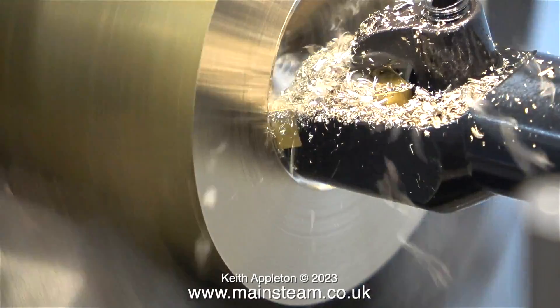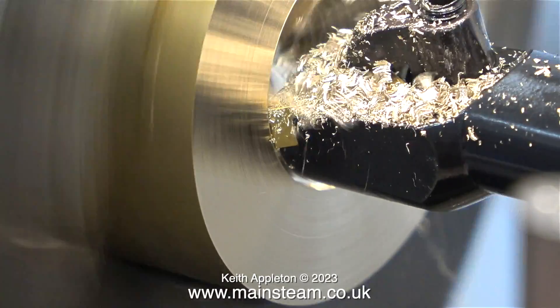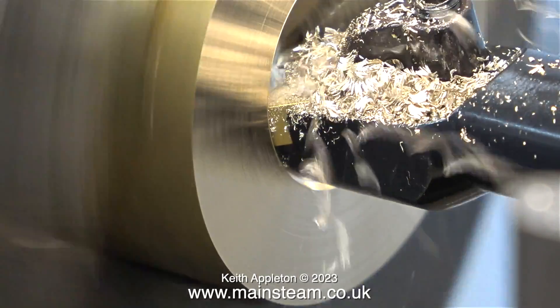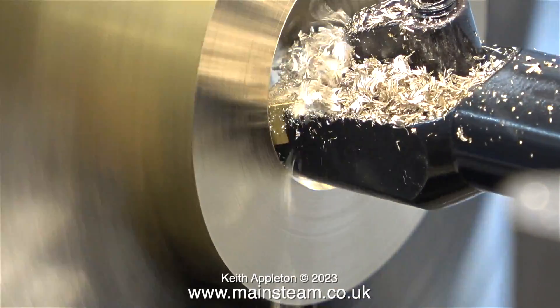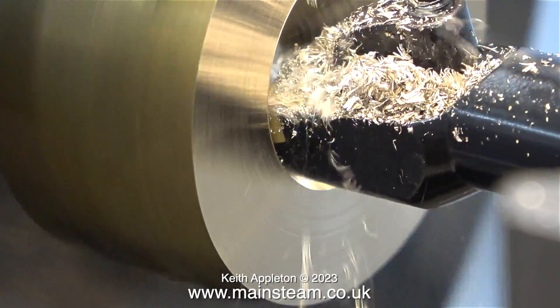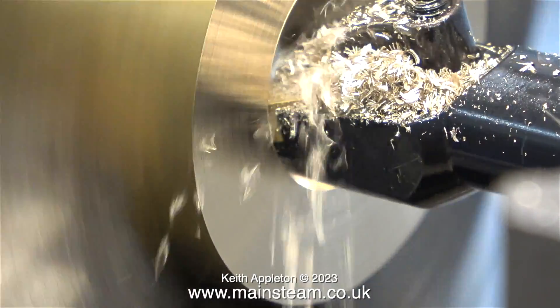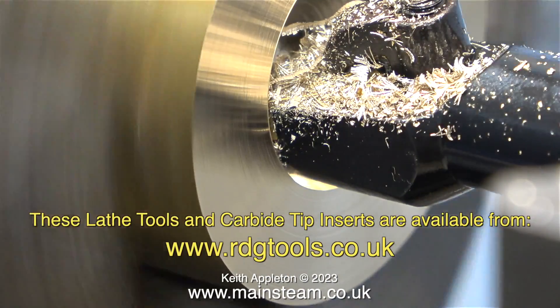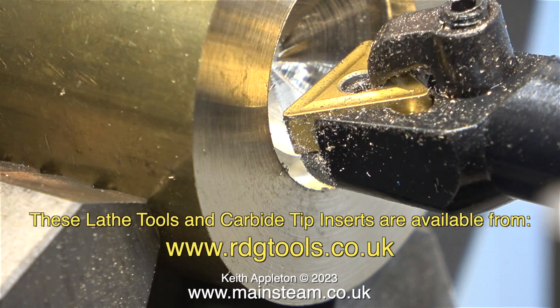It's time to test the boring bar at doing what it's supposed to do best, which of course is boring. This is only a piece of brass — not steel, stainless steel, or even cast iron — but the piece of brass is cutting beautifully. All the chips are very uniform and I'm sure they're quite sharp, but I'm not going to stick my finger in them. I can't fault this cutting tool, nor the other one. When I look at how much they cost me — with 20 tips, that's 10 for each — not much over £100, well worth it. My recommendation is: try and buy carbide tip inserts that allow you more than two surfaces to cut, preferably six, like the ones I've shown here.